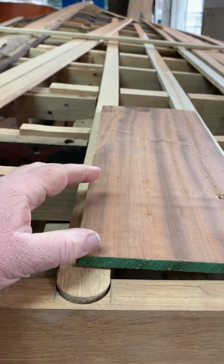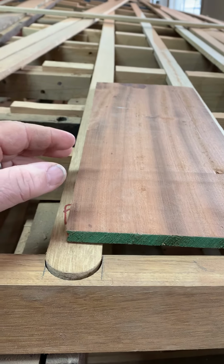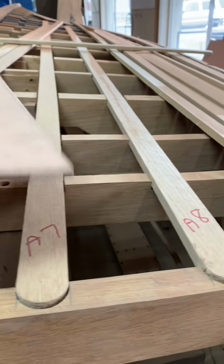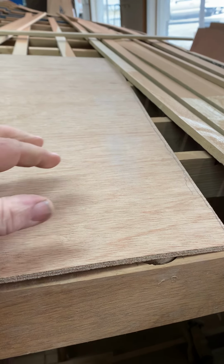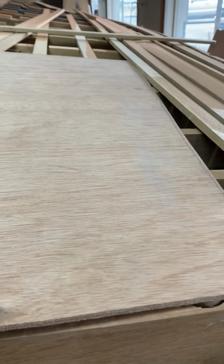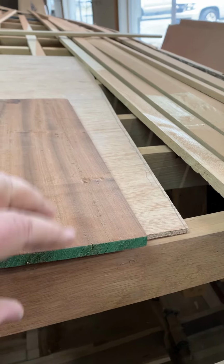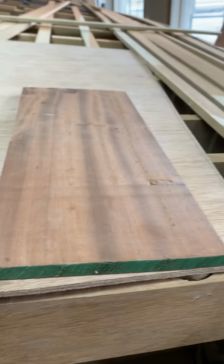being the clamps that hold the plank in place while the 5200 sets. Or we can go ahead and put a layer of plywood on over the battens. We don't eliminate the battens. We would put a layer of plywood on over the battens. That's your first waterproof layer, and then every plank is bedded in a continuous layer with no gaps, no voids of 3M 5200 between layers.